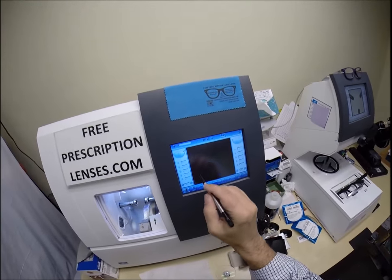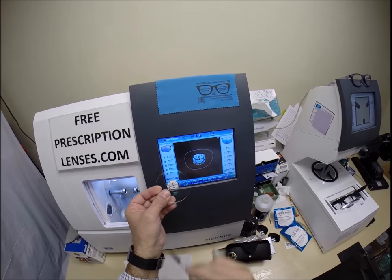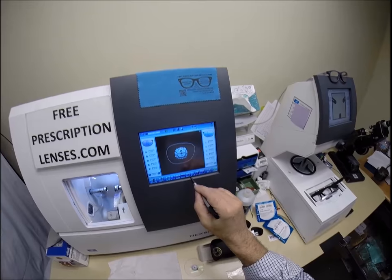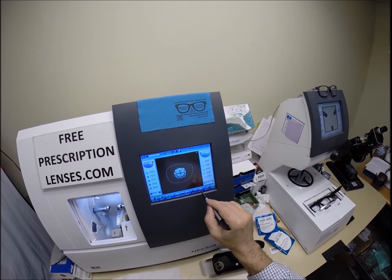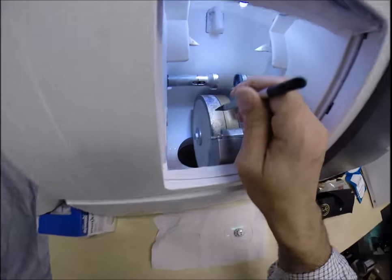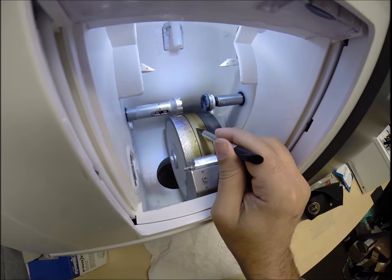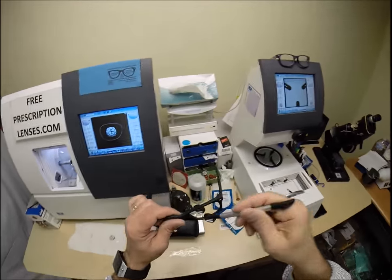Let's wake up the computer — 519 — and that is now the shape we're cutting. These are polycarbonate lenses; if they were plastic, high-index plastic, or trivex I would select that instead. I'm going to cut on the fast cycle and only put a safety bevel on the rear concave surface. The cutting wheel is a diamond-crusted wheel that grinds away the lens material, and the center wheel puts the V-shaped bevel onto the lens so it stays inside the bevel of the frame.